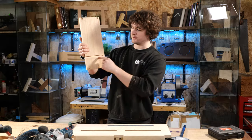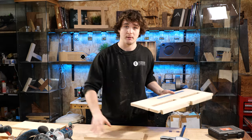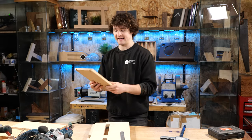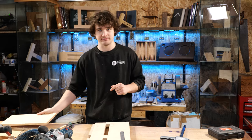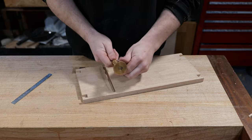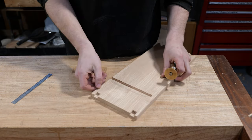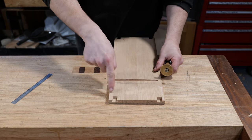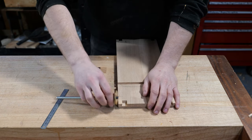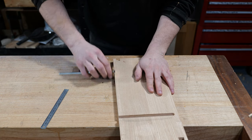There we go — one stopped groove, coming in from the back of the cabinet and stopping before it blasts through the front. This jig is able to do both sides of the cabinet by using each half. Before we finish this episode, I'm going to quickly show you how to cut the back rebate on the router table. To lay out this groove I'm going to use a marking gauge before taking the first cut. We know the back panel is going to be 4 millimeters thick, so we'll set the gauge to 4 millimeters and scribe that down the back of the cabinet on the inside face only.